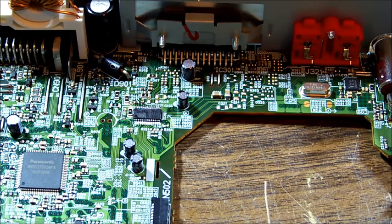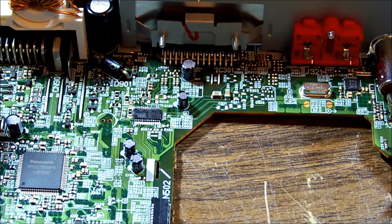If it's still present on the pad for that pin, but not the pin itself, it might be that something further before the IC is injecting that signal. And I'm pretty sure it was all of the inputs. I'll just double check that, but I'm pretty sure each one of those inputs had 3 volts on it, which is interesting because they each go off to a different source, be it the front auxiliary connector or CD audio or the tuner, for example. It would be interesting to know why they all have that offset.